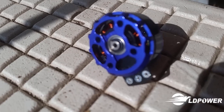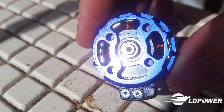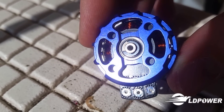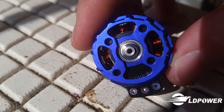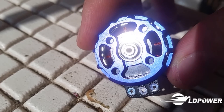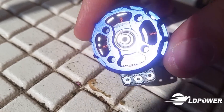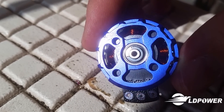The audio for this clip completely washed out due to wind, but I'm outside holding this motor and I want to show you something. I tried the longer screws, and you can see the PDB extends all the way over the screw holes, so you can't run a longer screw without accidentally hitting the motor windings. I'm going to have to either find screws that fit halfway in between, or use the short ones with a lot of Loctite. It's an awkward size because of my frame thickness.